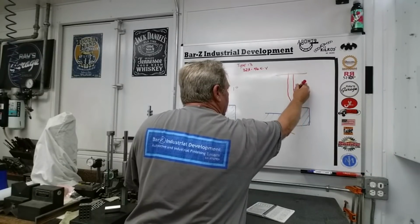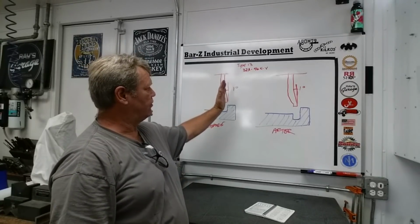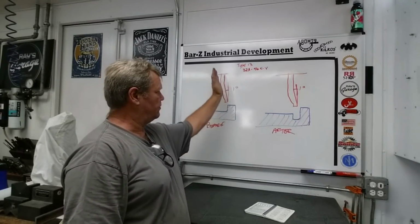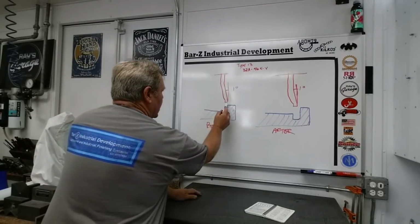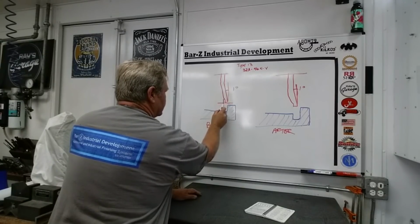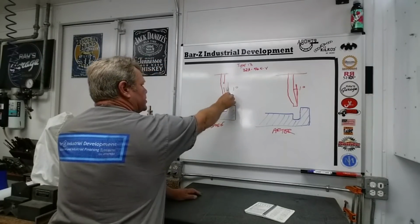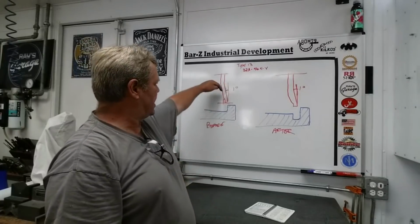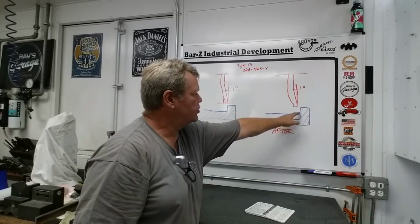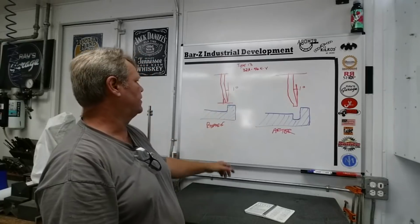So it's not a large cutback. All I'm doing is taking that radius and tangent dresser, just tipping it back 1 degree and skimming that surface there. The bottom, I run a diamond across it dead flat, and up this backside, I run it straight up vertical. So I've got two 90 degree sides, but that one backside is just tilted back 1 degree. This enables me to get all the way down in the corner and make sure my surface is very vertical and I'm making the cut all the way down into that trough.